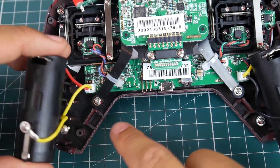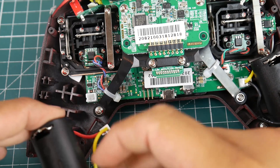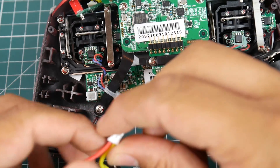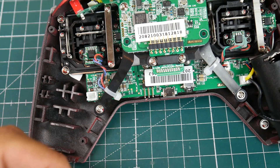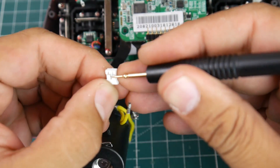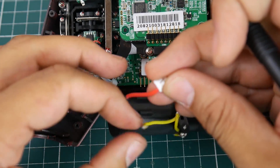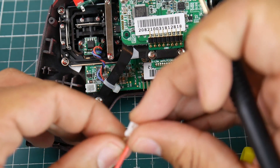It's just one screw right there. Once you remove it, pop this connector off. So what we want to do next is switch these two wires. Just pop these off — be very careful with these, don't push too much — and then that'll come off, and the next one. We just want to invert them. If you invert these, please never put back your batteries or you will possibly burn your FrSky. You have to unplug it and revert these back.